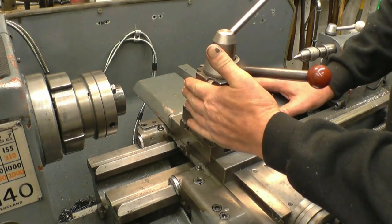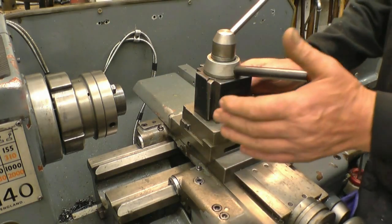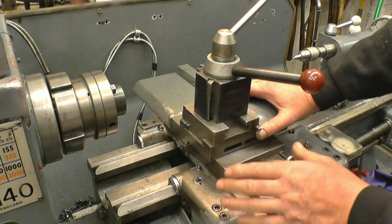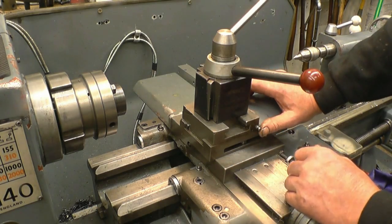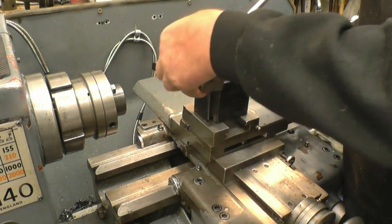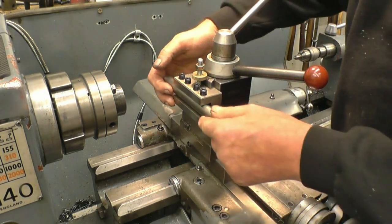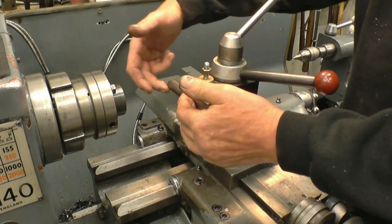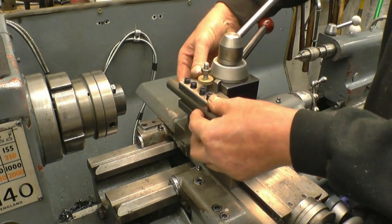You can have an angle plate with a vice on it, an angle plate with a component clamped to it, or ideally a vertical slide. Before I had a milling machine I did all my milling on a little Chinese lathe with a small vertical slide, and it was amazing — if you took your time you could get very acceptable results. For this particular job I'll just put the tool holder on; the piece of bar miraculously fits in there so I can clamp it, put the milling cutter in, do the milling operation, and also adjust the height to get it on centre height.